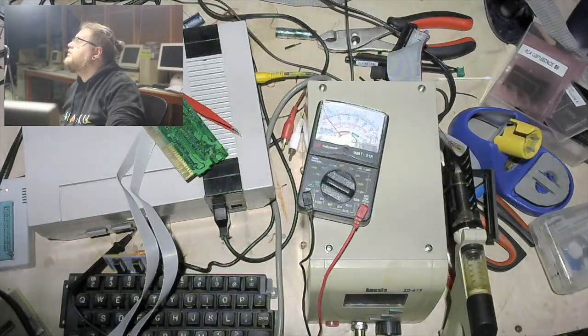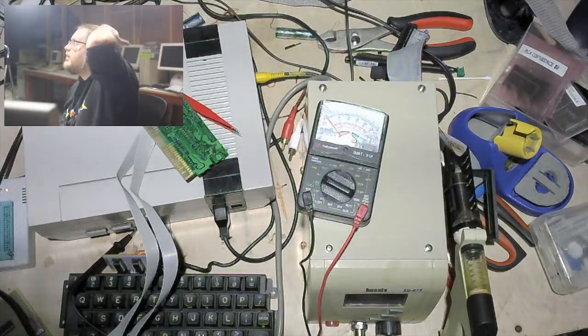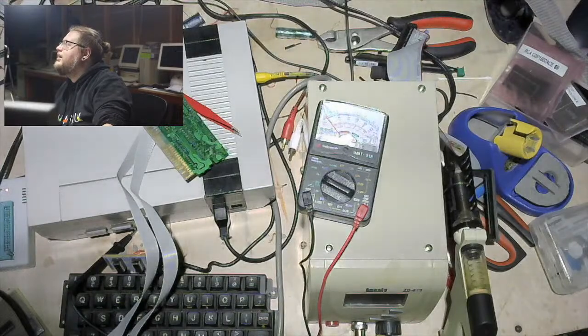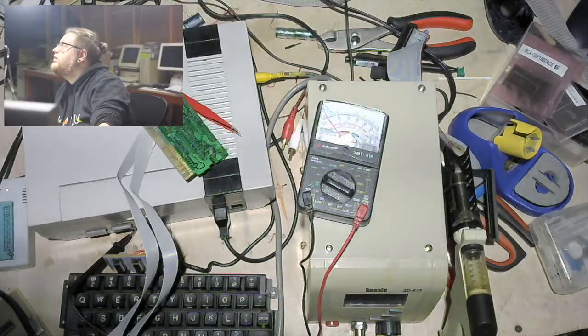You can take a 256-byte address space and latch the lower 8 address bits to be written to the address on the next read. Oh, yeah. So I was thinking in the back of my head about something like that, but I think it's just not worth it. It's way more complicated than just doing this and stealing that chip enable and stealing some chunks of memory.